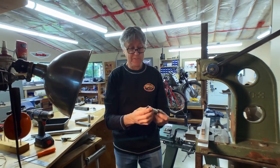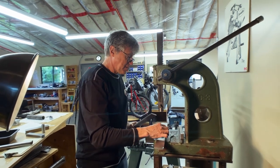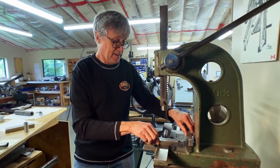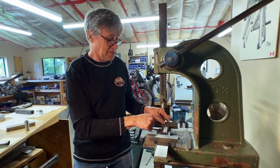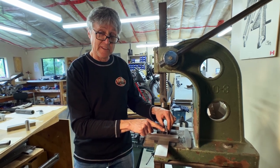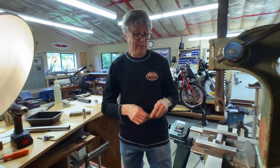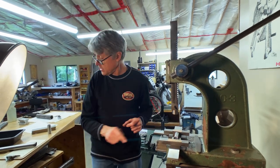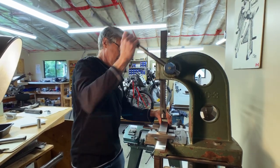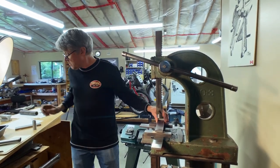On these extension tubes we want the whole thing to be ovalized equally. I'll put the tube in the middle and put some plates on each end. I've got a three-quarter inch plate on each side - this is an inch tube and I want to take it down to a little less than seven-eighths, which is the OD of the handlebar. I'll use a little bit of cardboard on each end. This is a heavier tube so it's going to take a little more force - we need a spacer like this.